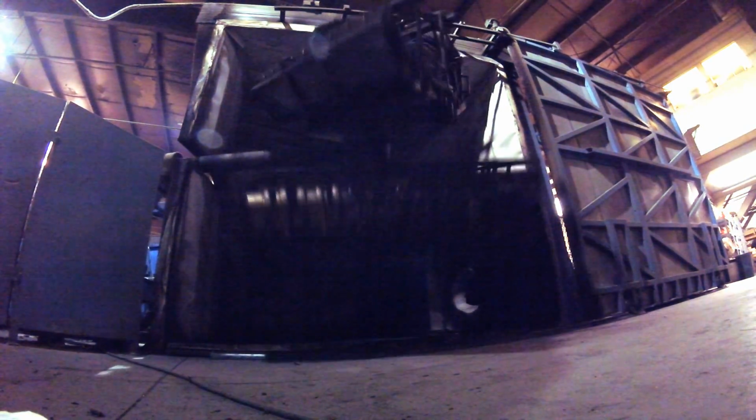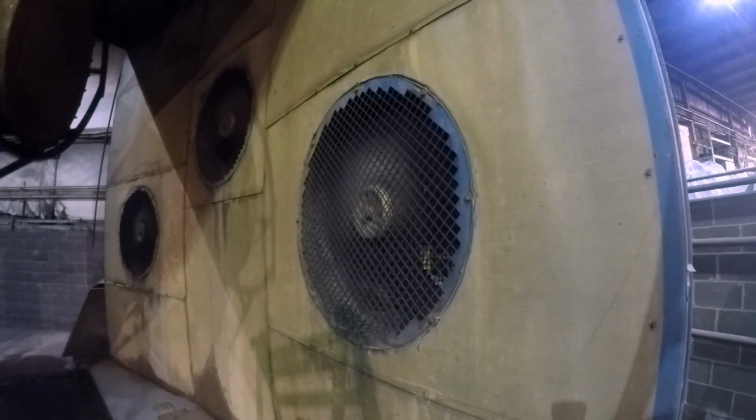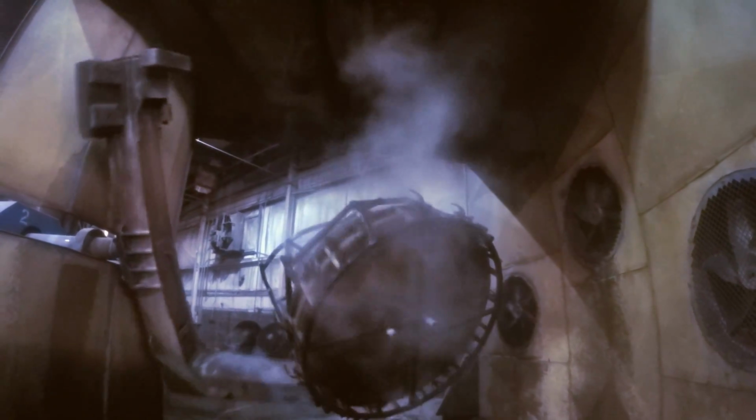Stage 3. Pre-cooling and cooling. After completing the cook cycle, the mold is then moved to the cooling chamber and cooled by air or water spray or a combination of both while still rotating, thus lowering the temperature in a gradual manner.